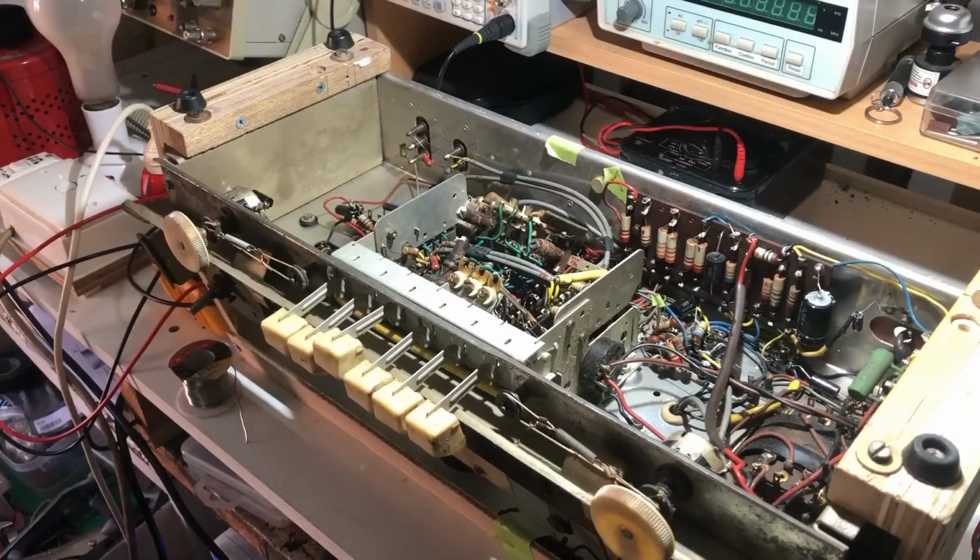Well, here we are again. The radio was going reasonably well, but on Friday I took all the valves out of it and took them to my friend Ron's place and asked him to put them on his valve tester, and they all tested okay. So that remaining crackling noise was not coming from any of the valves, so at least that's eliminated them. Of course you can't test a valve for being noisy, at least not on the equipment he has, and he's got some pretty good gear.